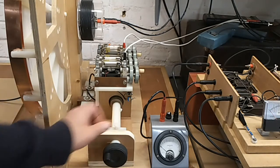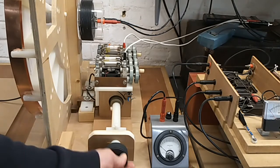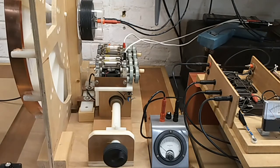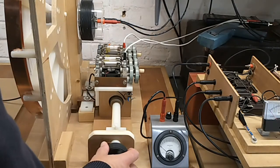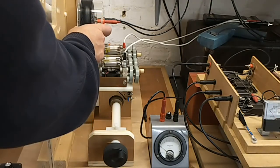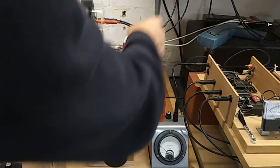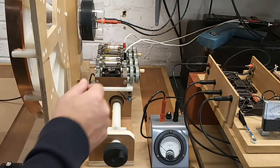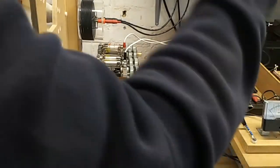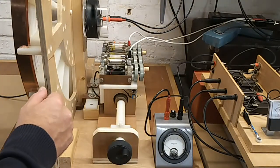When we adjust the capacitance, we can turn it right up and right down — fully closed and fully open. It's currently set at 1,200 picofarads. Behind the main transmit coil we've got a pickup coil used to drive the vacuum tube as an oscillator, forming part of a Colpitts oscillator. It picks off a little bit of the signal and uses that as positive feedback, which starts the valve tubes oscillating, which in turn drives through the primary circuit.